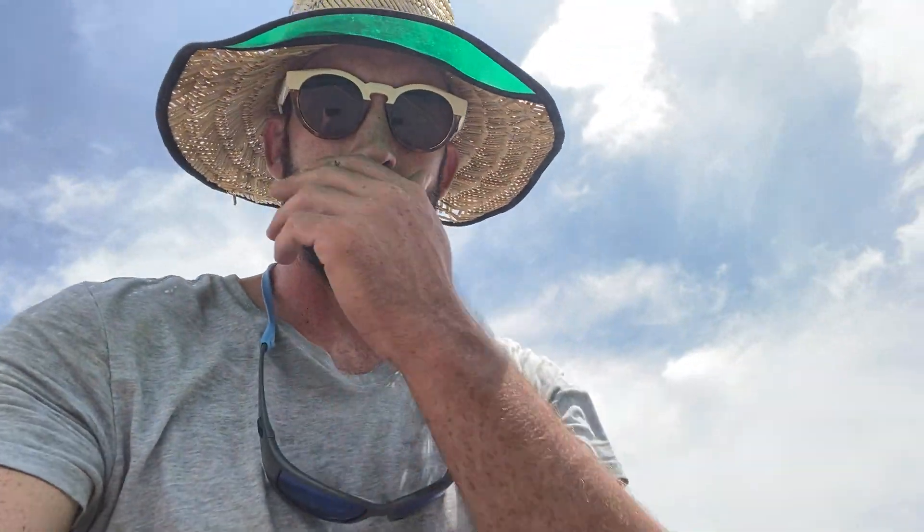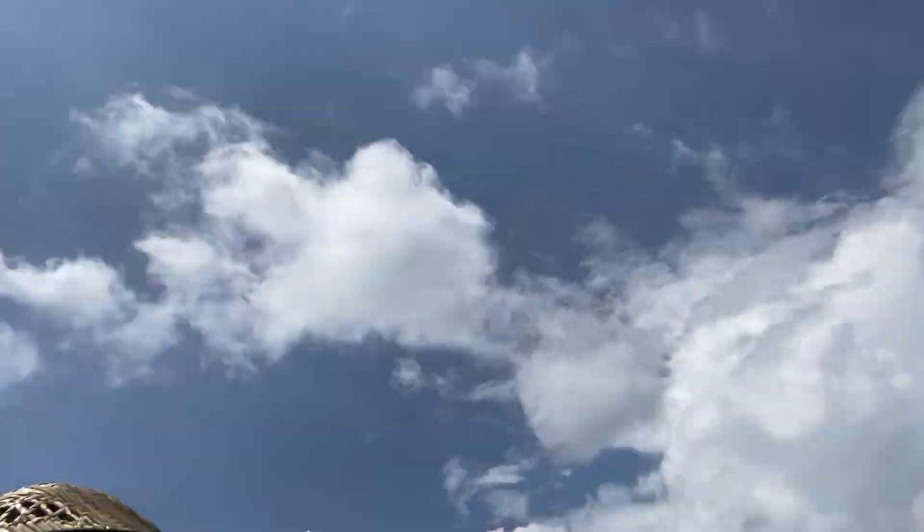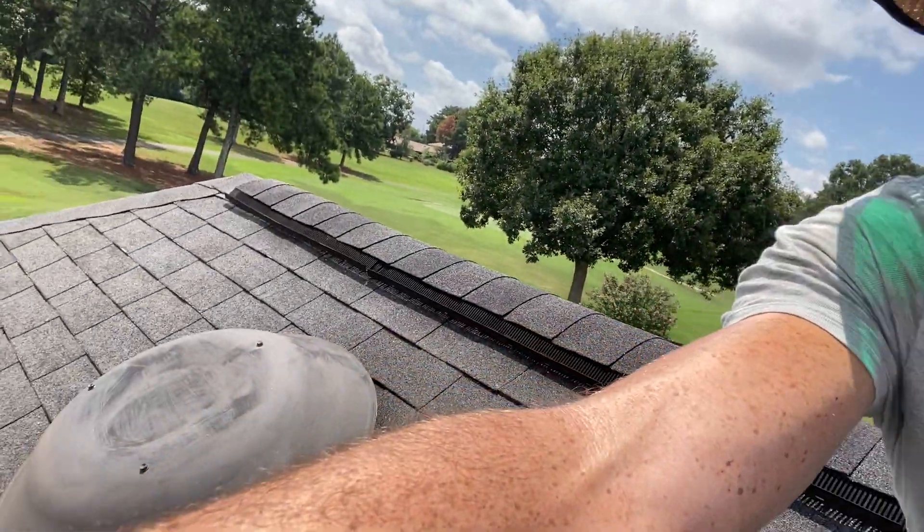Right now I'm on the neighbor's roof. A nice couple just came outside and wanted me to check for hail damage. But the reason I'm making this video is that we've got a ventilation issue on this roof. Apart from hail damage, we've got two ridges — one up there and I'm sitting on a lower ridge right here — and what we've got is over-exhaust ventilation.